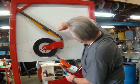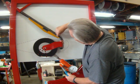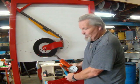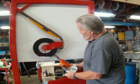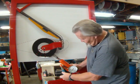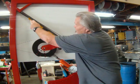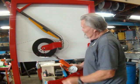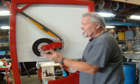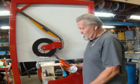Now if you look, you see that the gear leg, because it's deflecting here, is starting to come down and close the gap against the brace. Now, once the gear leg closes that gap, we're at the 400 pounds. It's closed the gap. You really don't want the gear leg to deflect back any more than this. This is pretty much the maximum that it should see.